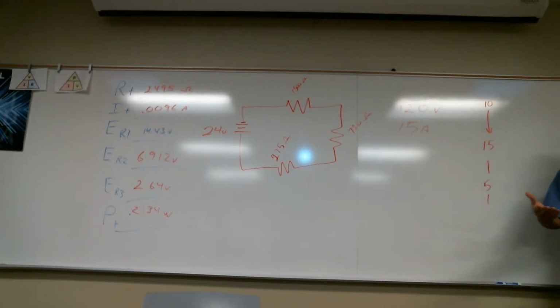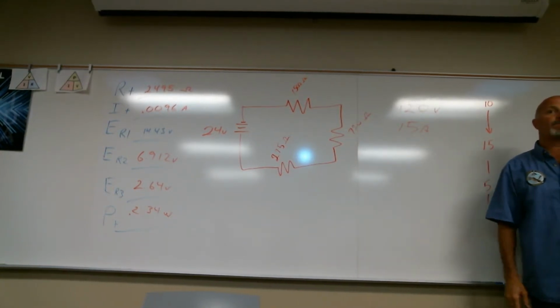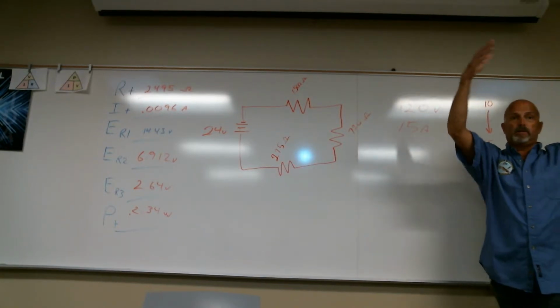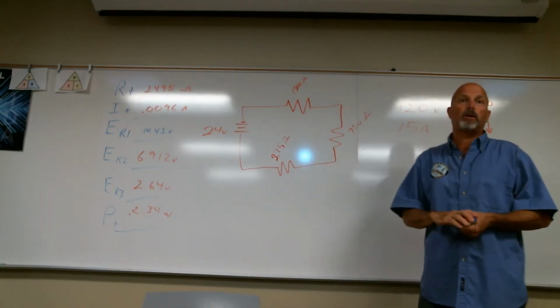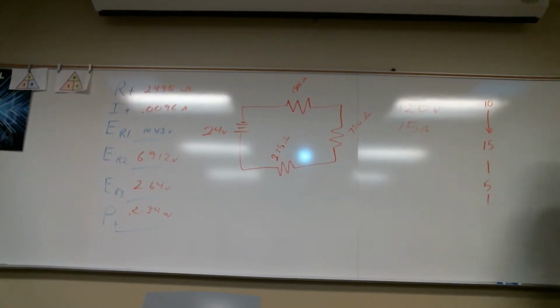Yeah, I just did my kitchen, so I looked at the wattage on my coffee maker and my toaster oven because they were going to be on one wall, and I figured the wattages, and I had to run separate circuits. Plus, I had a fan over my stove, and they were all together. So then I had to figure out, can I run those on one 15 amp breaker, or do I need to separate them to different breakers? You're not necessarily going to be rebuilding a kitchen, but when you have loads, this stuff is going to come to mind. We'll continue to see examples.